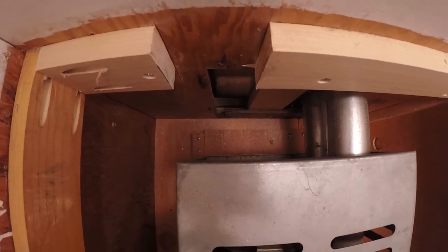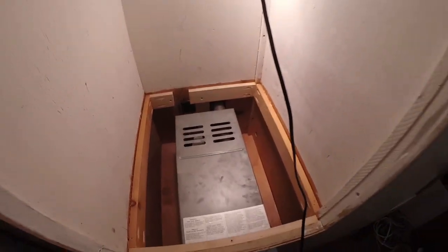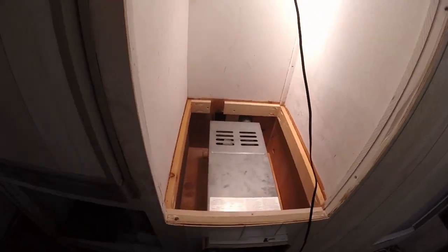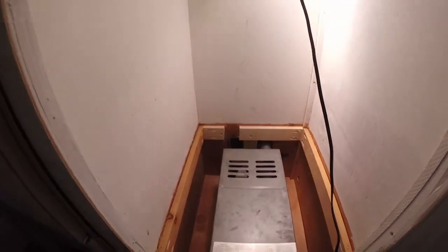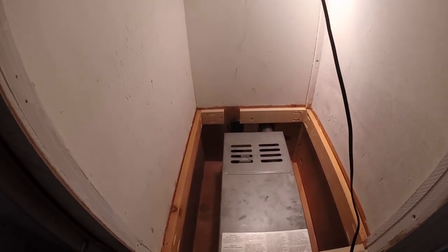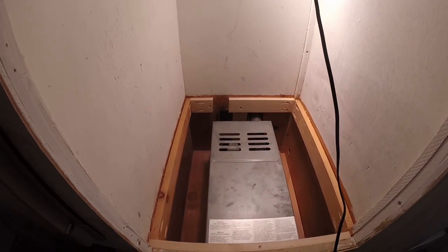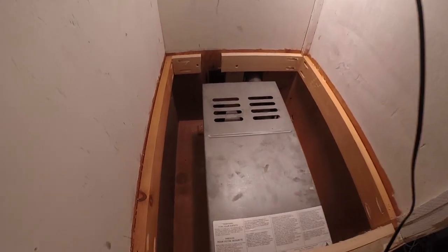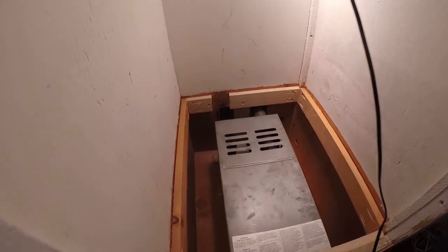I've got to drill a couple of holes down there for the pipe to come through — it's going to be very tight quarters, so I'm going to take the heater out. I measured from there over to that point — that's between 74 and 75 inches, and that's a slight over-measurement. You always want to cut things a little longer if you don't know exactly what they're going to be.